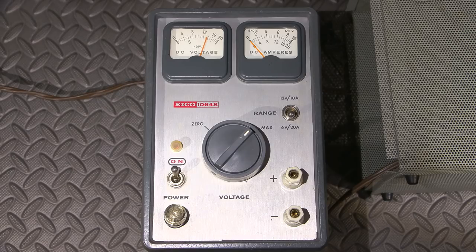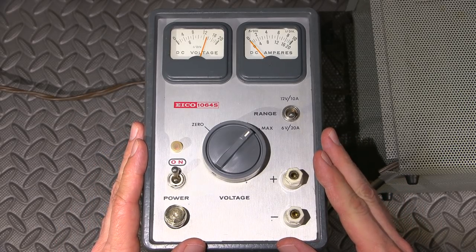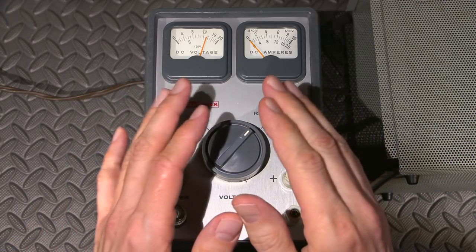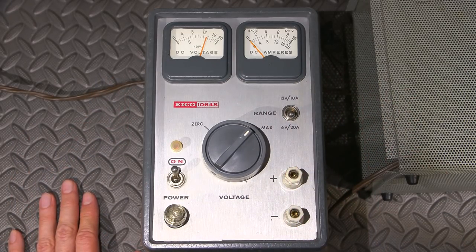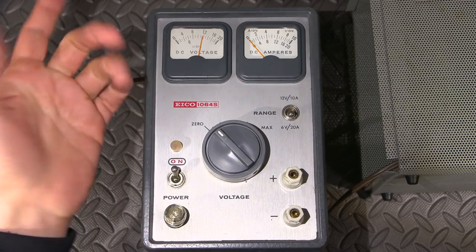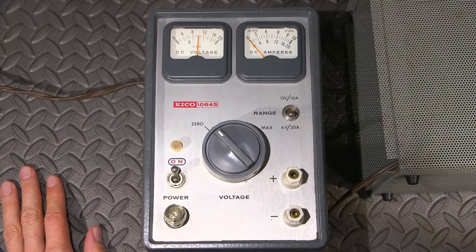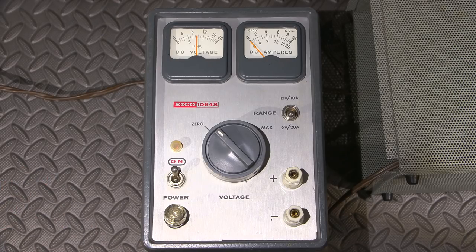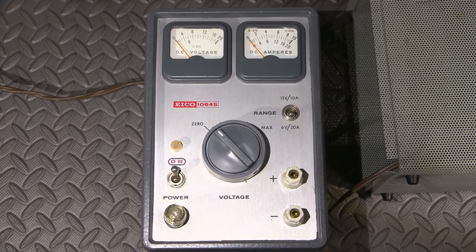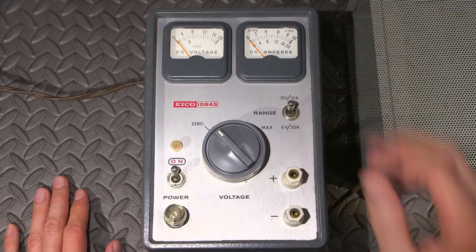If I let go, it comes back up again - no problems. Those resistors are getting mighty toasty. So that's working, that's absolutely normal. If I turn this down, the capacitors are working very well too - right now this should just fall to zero if the caps were bad. I'll grab these very hot resistors by the corners to drain the capacitor off. No problems - the capacitors are fine.